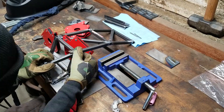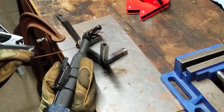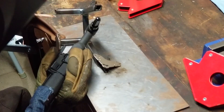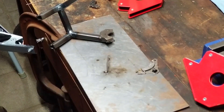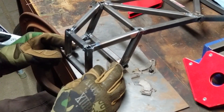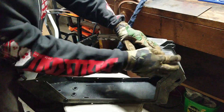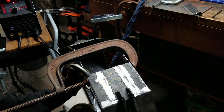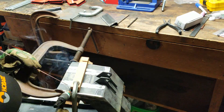The only alternatives are either I become someone who's magically great at everything the first time, or I make a 49-part project where each video is four hours long iterating over this part thousands of times. Here's a good example of that: I fully welded out the inside thinking I'd make everything strong, and then something must have came off because that front part is not aligned anymore. At that point it was time to take a break from the truss and move on to something I was actually more nervous about messing up. Welding thicker material is more forgiving for a beginner welder, so I was a little nervous about blowing holes in the sheet metal, but it came out okay.